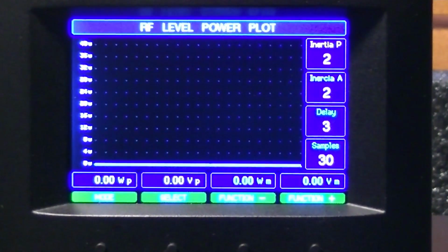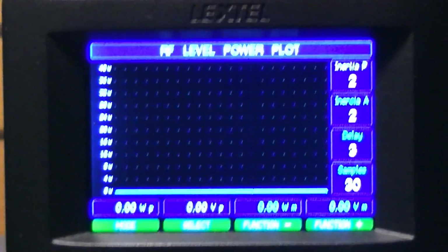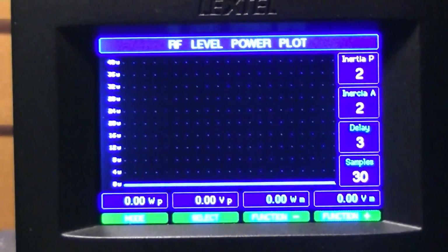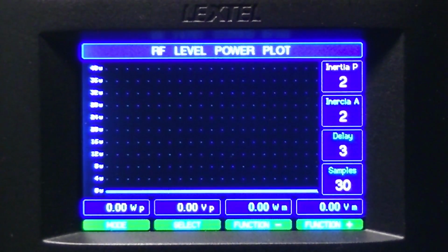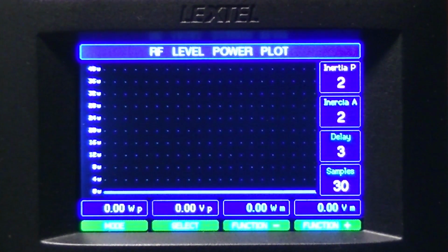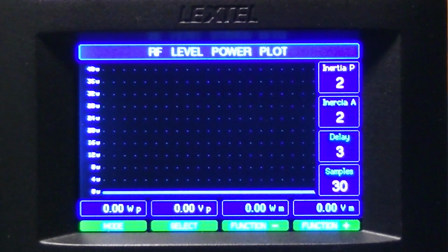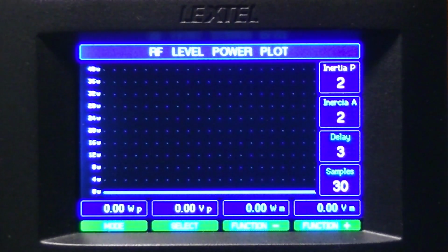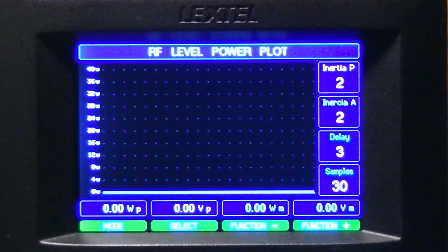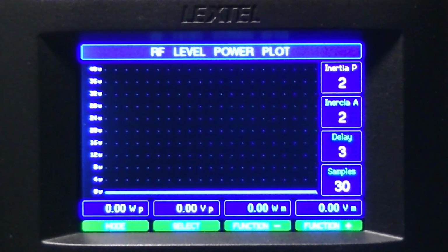Let's zoom in here a little bit. I'll also bring into the screen the computer screen, where I have an SDR radio on the frequency of 27205, which is essentially channel 20. The first test will be in AM, and I'm going to run it with 25% of the microphone gain on the Dynamike Plus by Cobra. So let's start.